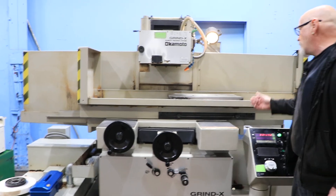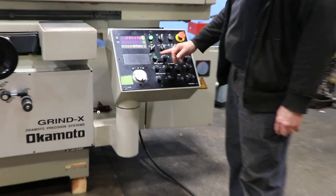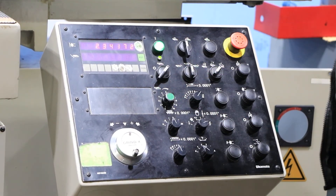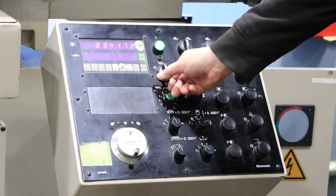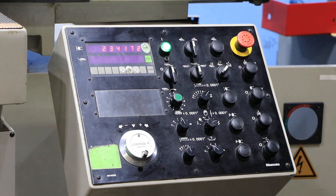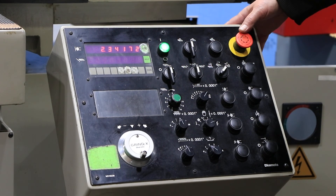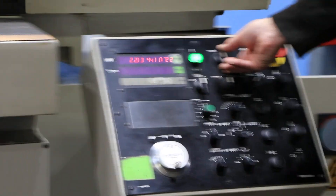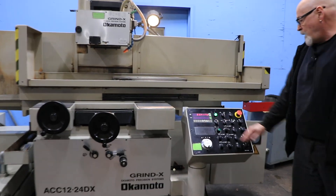The magnet is a nice big 12 by 24. You've got a switch on the panel to turn that on and also to adjust the magnetism from very low to its maximum. You have a light here to tell you that it's on. You can just shut it off or you can demag by going over to the left and it spring-loads back to the center. You've got your emergency stop button and your table start and stop, plus an indicator light that the machine is on.